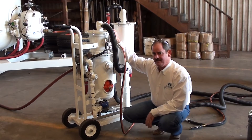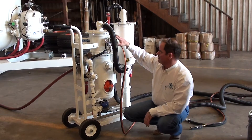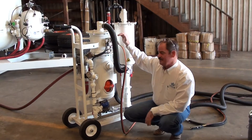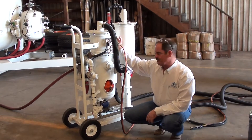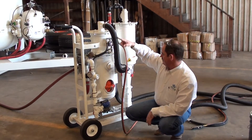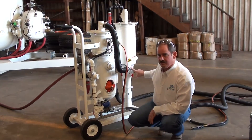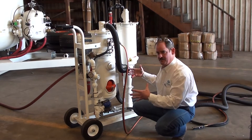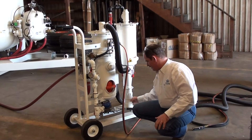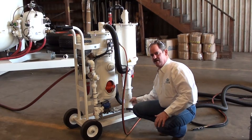The piece on top of it is a reclaimer. This is where all of the spent abrasive is brought back into and separated. So your spent abrasive is reusable and falls back down for reuse in the vessel. The dust is brought over into the cyclone on the bottom where it's centrifugally separated, so the majority of your dust ends up in this cap on the bottom for disposal.